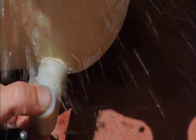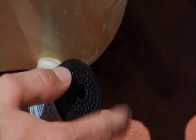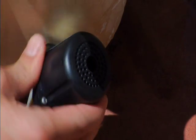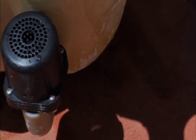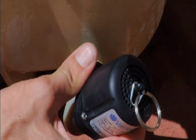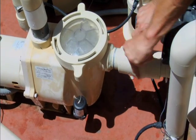Offset installation port valves can be used, allowing the valve to remain closer to the pump housing. Breather 2 models require that the sealing element be manually reset after a high vacuum occurrence. Hold the valve and pull the chain, re-engaging the sealing element for normal operation.